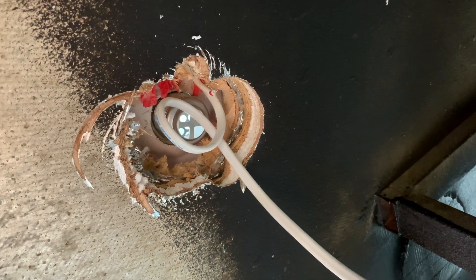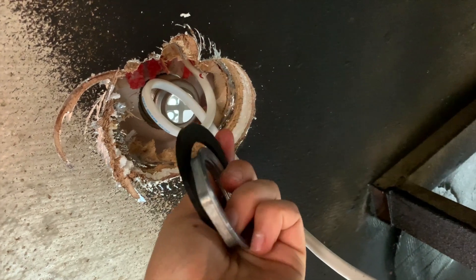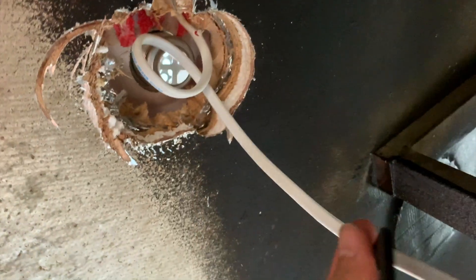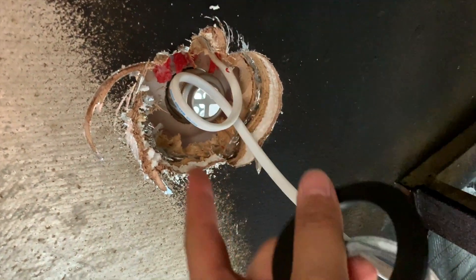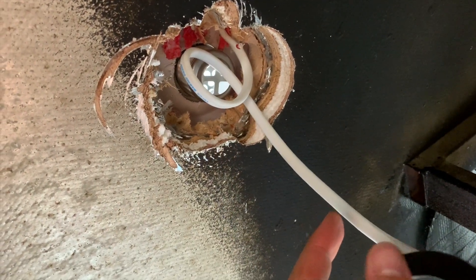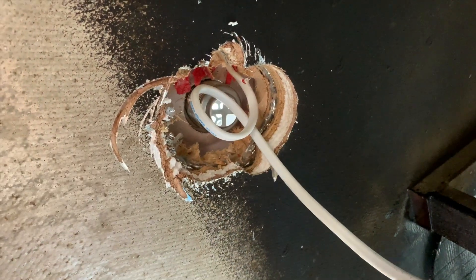That's a big step when installing a shower pan — you should get the drain installed first with all accessories coming down so you can just put it through the hole. I probably only needed a two-inch hole, but now I have this monstrosity because my circular drill bit wasn't working and I had to use a one-inch bit to open it up.